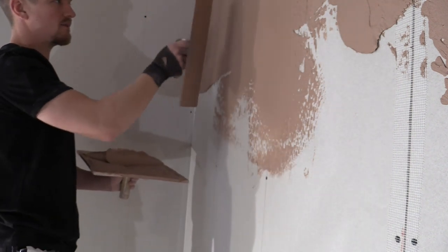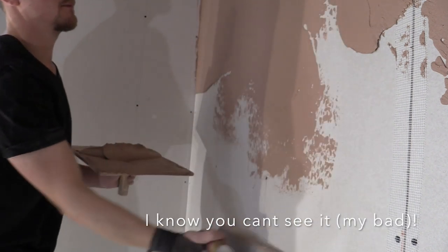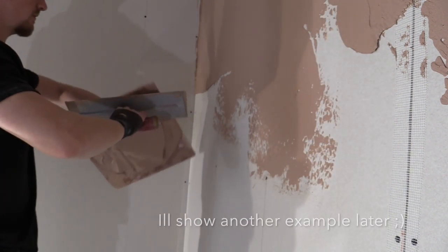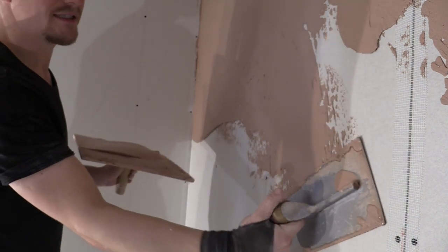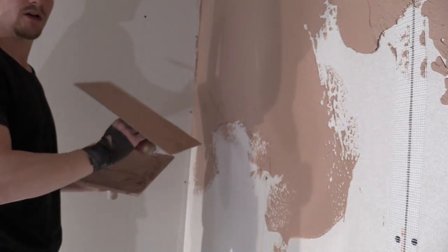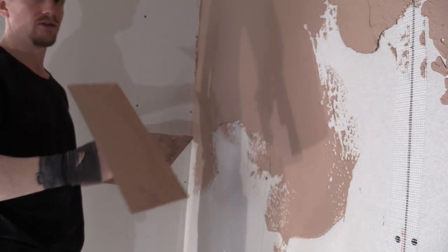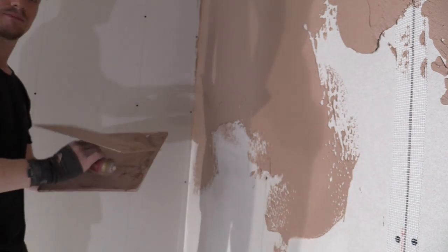But again, that looks a bit bubbly, can you see? I'd go over that. Now I've smoothed it off. Take your plaster. And then again, this is where I come back on myself. Take it out. You want to be doing it now. You don't want to be leaving it too late. The smoother this wall is at the beginning stages, the better. And this is part of plastering.